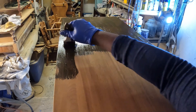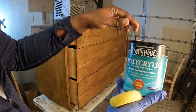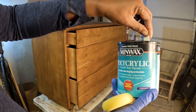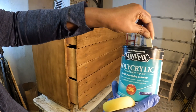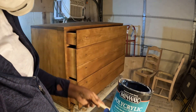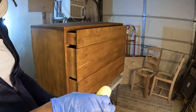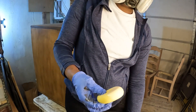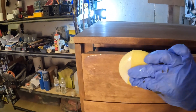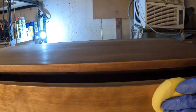Sometimes you'll have a piece and they use different wood for different parts of it, and you're steady trying to make it all the same. Now I'm putting on the Minwax Polycrylic in clear matte. It has no gloss to it — it's a finished look, though, not unfinished. I would definitely take a matte over a gloss. Satin is maybe my favorite, but this is pretty good too.